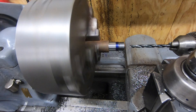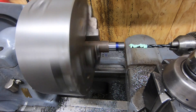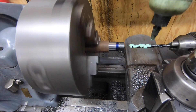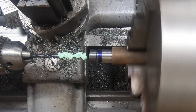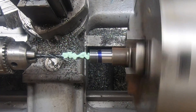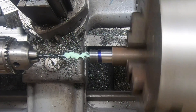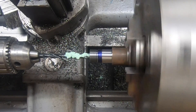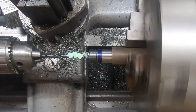The riser gets bolted to the base with a socket head cap screw. Rather than cut this off and turn it around to drill and tap it from the other end, I'm just going to drill and tap it all the way through from this end. I'll put a little Anchor Lube - my lubrication of choice - on a letter F drill and drill it a couple inches deep into this stock.